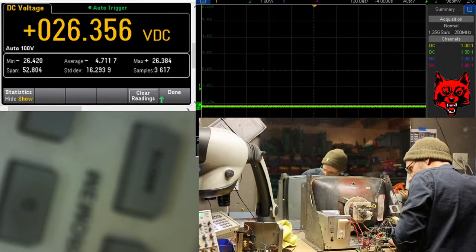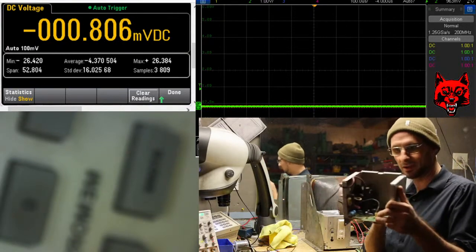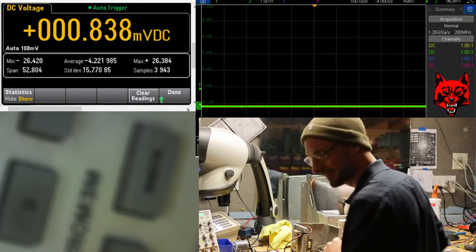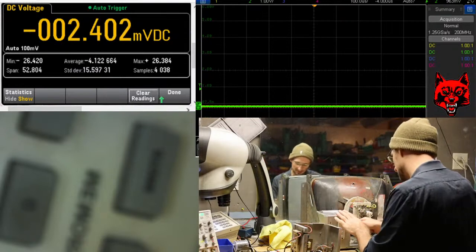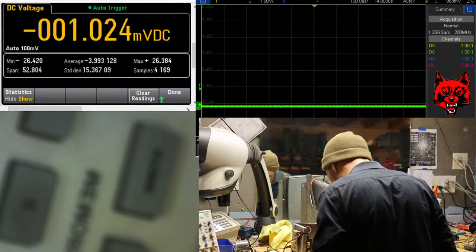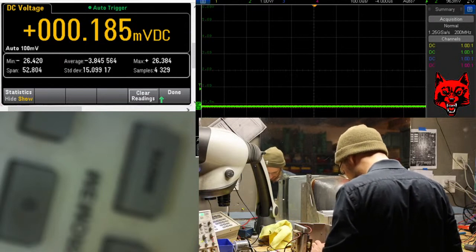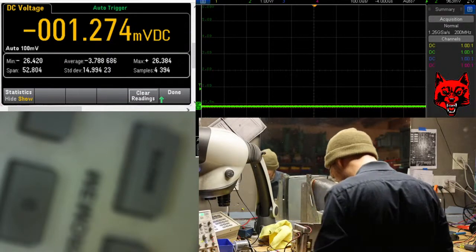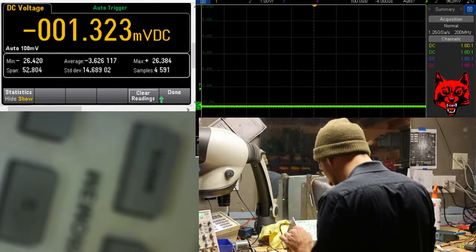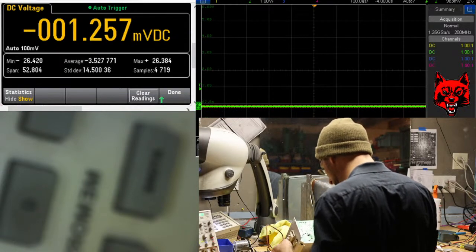Now, I don't have an image because I don't have high voltage, but this is the second part of his repair I'm going to work on. It may work. Should we try it? Yeah, let's try it. Let's see what happens. But it looks pretty. I see two burnt resistors. Doesn't mean they're bad. This one's pretty crusty. That HV potentiometer looks crusty. The soldering's horrible under here, so that's going to get all redone.